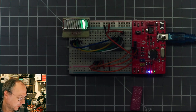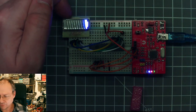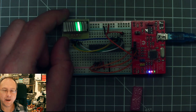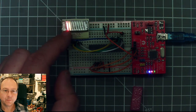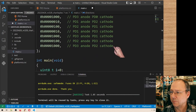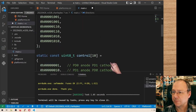And, well, something weird happens for the last pair where there's no LEDs connected, as you have seen. Actually, we have some lighting up of different other combinations, and this is because the 5 volts of the supply here are enough to get current through two series connected LEDs when there's nothing else in the way, which clamps the voltage. So let's actually get them to shine in the correct order and to get rid of the last pair. So we go back here. The last pair is obviously the last pair in our list here because it was the last one which showed up there. I could have left the definition in here for further future use. Well, I don't think that's necessary.